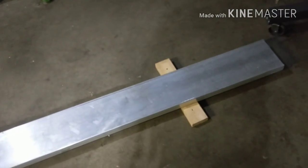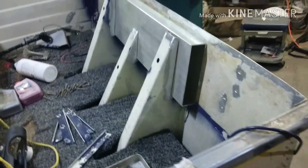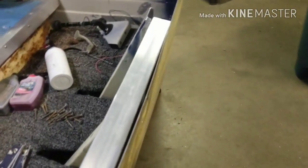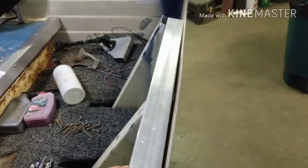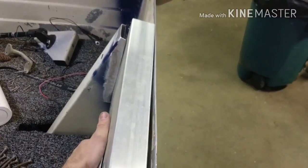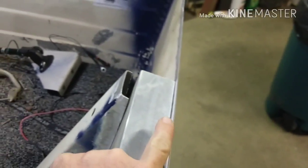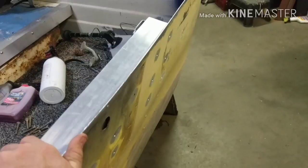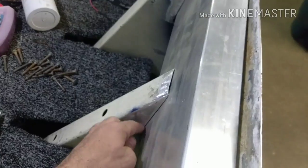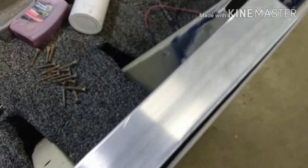This is going to go the full length. I got the piece sitting right here to cut. The piece that's in here right now is just to give an idea of what's going to happen. Since that top cap was junk, we're going to weld this new piece flush with the top. Then we're going to run a bead of weld all the way along the top and join the back plate here on the transom to the new transom board. And then this is all going to get welded around here and it's going to be pretty damn solid.